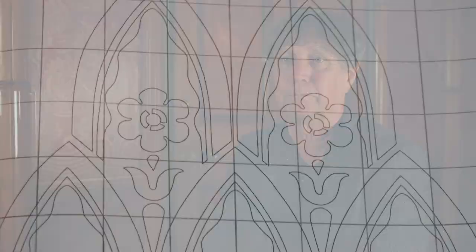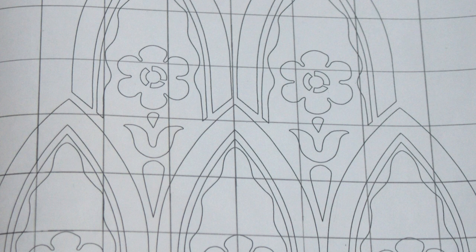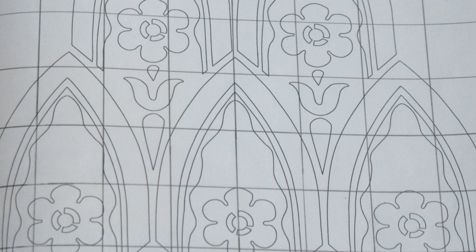There were still aspects of it which are slightly mysterious. There are some areas which look as if they might have been worked using a stencil, and others which look almost as if they might have been printed. But the best preserved areas were obviously done by hand, so it was a hand process directly on the wall originally, we believe. Anne very carefully plotted out how this would have worked across the walls of the room. Once the ground colour and the ground paper had been put on the wall, she had to literally draw every one very finely in pencil on a kind of grid that relied on laser devices and plumb lines, so that there would be no waviness in the scheme. It took months, as you can imagine. There were around 12,000 motifs and they all had to be placed in exactly the right position.